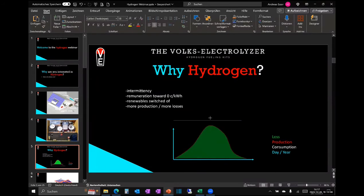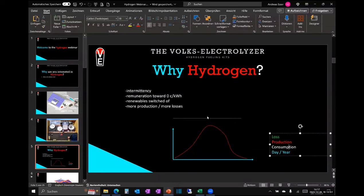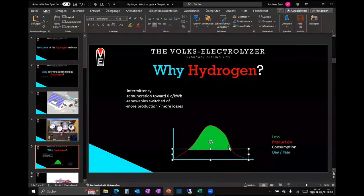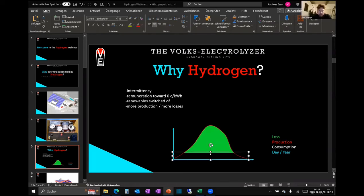When we started with solar, our consumption — the white line — was always higher than our renewable production. The grid could always take our photovoltaic electricity. But the more people get on board and produce renewable energies at the same time, the more consumption falls relative to production, and we will have losses shown in green. At a certain point the grid will not be happy to take our load, and what most people don't know is your AC inverter will switch off when the grid frequency rises — you wouldn't even be able to use photovoltaic electricity in your own house. This will happen more and more often the more renewables there are.